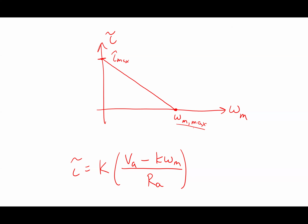Why was it doing that? There had to have been a load torque applied. Where was it coming from? Just the brushes, and whatever other friction is going on. There are bearings that hold this thing in place, and there's some friction. In a really nice, big motor, that would probably be a lot lower. So in this motor, I can't get all the way to the theoretical maximum. I probably get to somewhere around here. But this tells me the relationship.